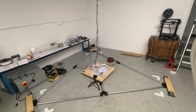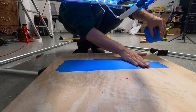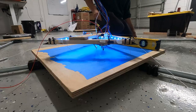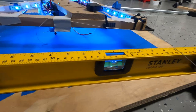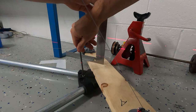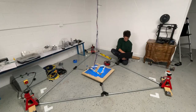Here's another beautiful benefit — I can move the whole base as one, where before I had to move each one individually. I went ahead and added masking tape to the base plate to help with first layer adhesion. I got this really thick painter's tape, it's really nice. You can see the other benefit of this base: I can adjust on three points the height and orientation of the build plate. I'm adjusting the height of each anchor, so now that I had the height adjusted, I had some really clean numbers that I can plug into the calibration.